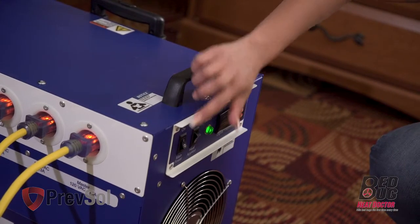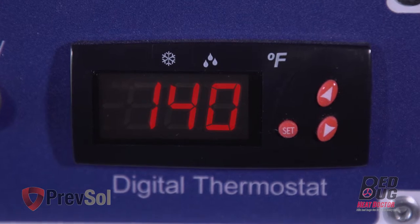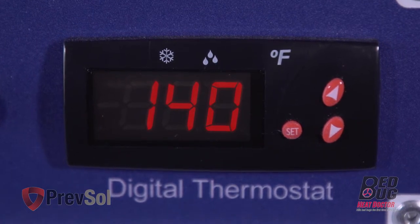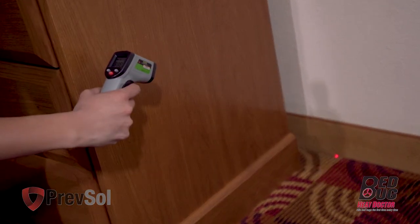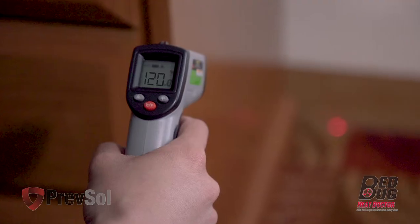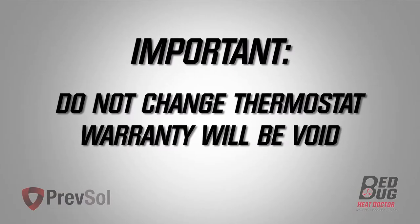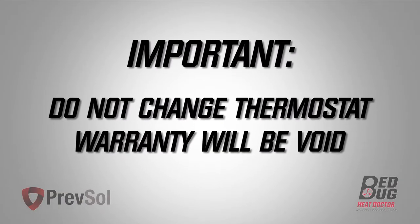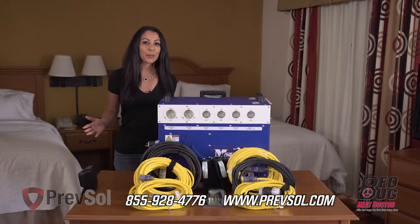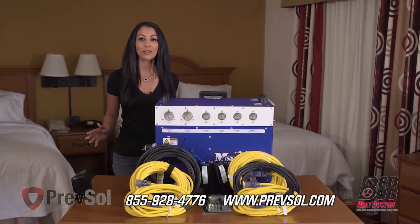In the last step, you're now ready to turn the power switch and fan switch on. Run the equipment until the temperature reaches 135 to 140 degrees. At that point, use your thermal gun to check your cracks and crevices of the coldest spot in the room. Those temperatures we want at 121 degrees for three to four hours. Do not change the thermostat or your warranty will be void. To learn more about the BK-15, call the number on your screen or visit prefsol.com.